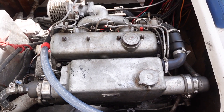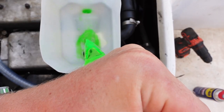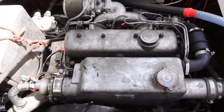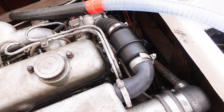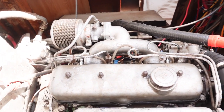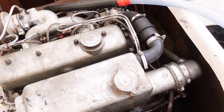Okay, it's a new day — let's get this beast fired up. For coolant I'm using coolant mixed with demineralised water so it doesn't rust the insides. Well, it was running a lot hotter than usual at 90°C. A lot of people said that's normal for a diesel engine, but the book says 85°C. Maybe the kink in the pipe, maybe the water or the engine is a bit warmer than usual because of the temperature. But the good news is the injectors work really well, the engine itself works really well. I just need to stop worrying — I'll keep an eye on it and do the throttle as well.